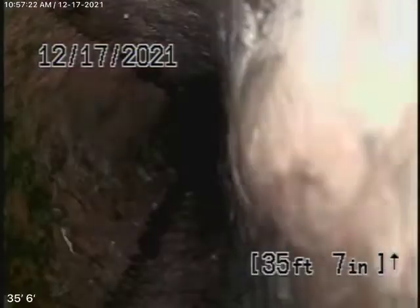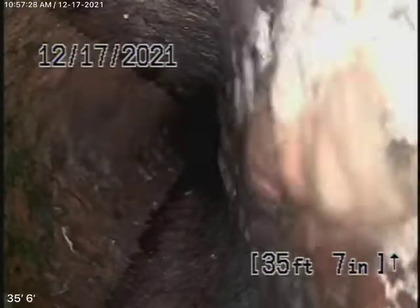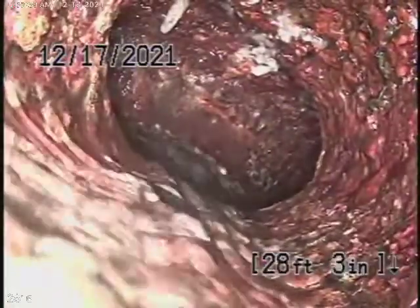I think what we'll do is try to flush it all out — let me go run a lot of water and we'll try to flush it out. So we've run a lot of water down the line and we've flushed pretty much the paper out. That's why I highly recommend that you have the general inspector check the plumbing to make sure it's not leaking. This is where the blockage was, right on the corner there.